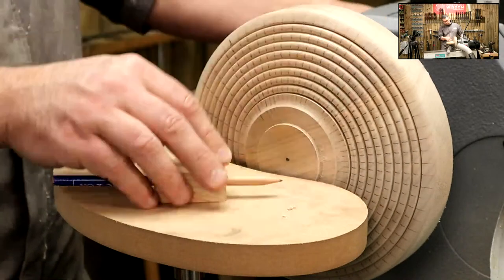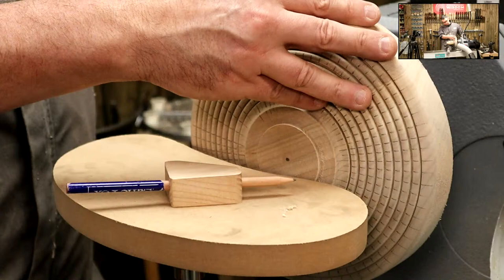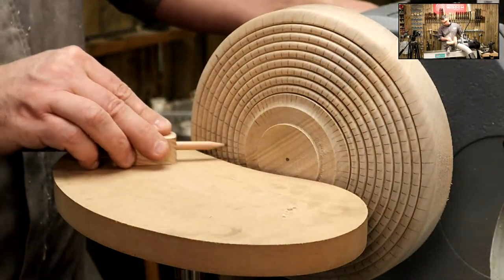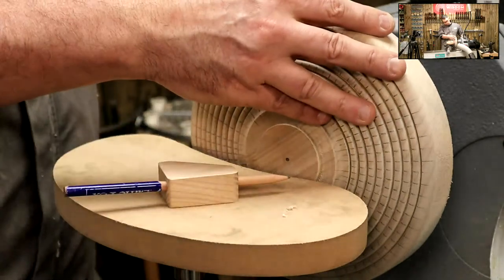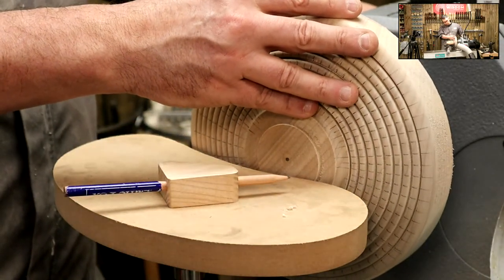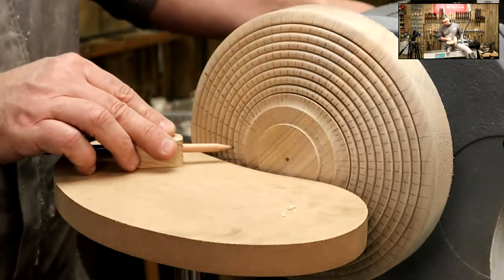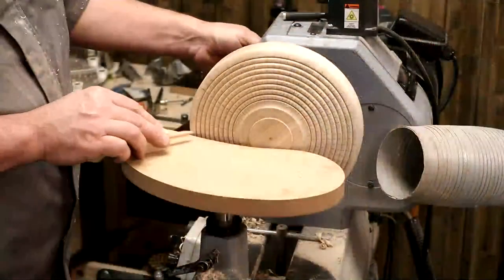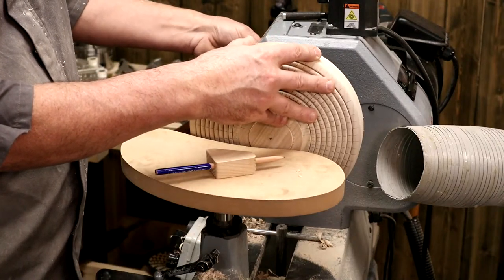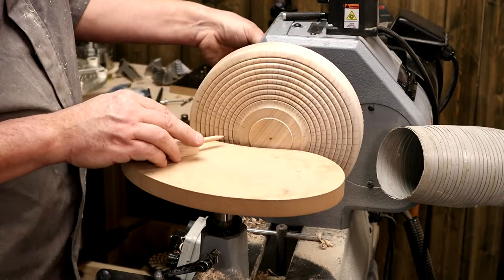Paul can't get a bead former. Could he use a diamond carbide scraper to form the beads and then take the skew to it? Would that be too dangerous? I suppose you could. If you set, for instance, a set of dividers to work out where everything should go and then put a V cut in with a carbide and then just feather around with a skew, I would have thought, but leave the skew flat as a scraper.